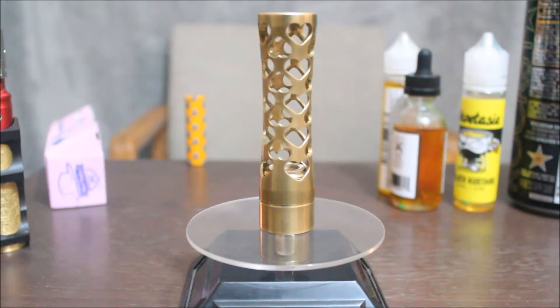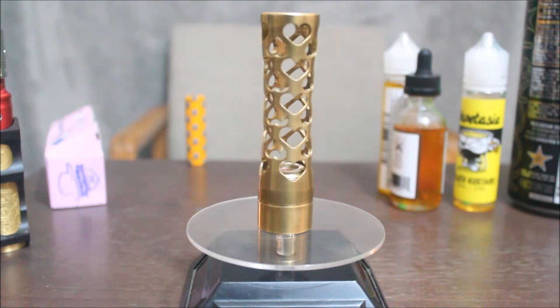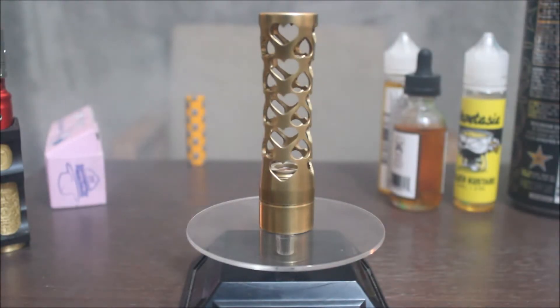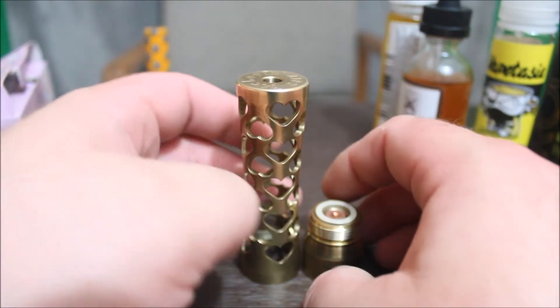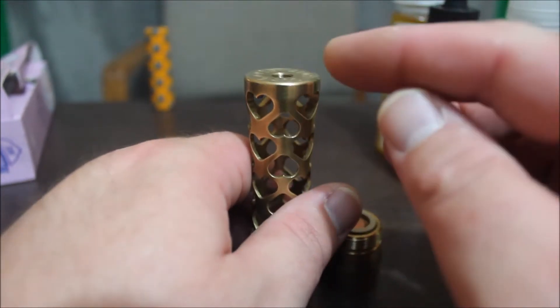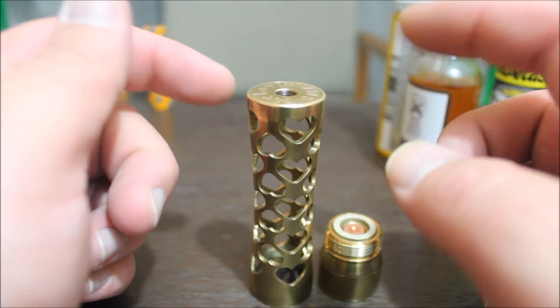Let's jump up close so you guys can check it out and see what I see, and then we'll talk a little bit more about it and I'll give it a final score. So here we are with the McLovin — as you can see this is a very simple, very diminutive, small mod. Although the top does fit a 24mm atomizer quite well, it is a hybrid top cap design, so if you have one of these you need to make sure your atomizer has a proud 510 pin — meaning the pin sticks out from the bottom enough to make contact with the battery without the body of the RDA making contact with the battery itself and causing a short.